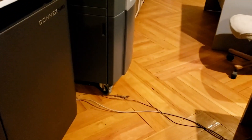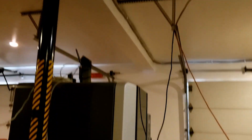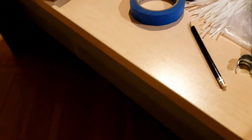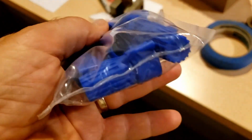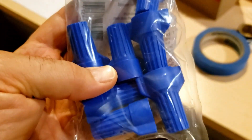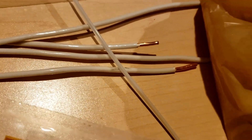So what I'm going to attempt to do — I'm going to wait a little bit, see if the lizard moves. They often stay there and then 10 minutes later it's gone. I'm going to see if I can wire up those two receptacle boxes today. I got these wire connectors for binding all the wires together, twist all the wires together. I had to get these larger ones because the smaller ones won't fit for a size 10 wire.